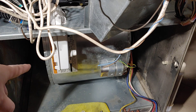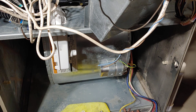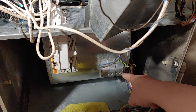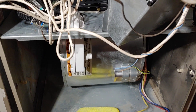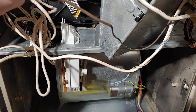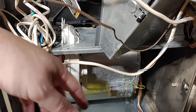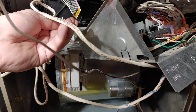I got the motor for $150. This capacitor is literally $5 at a Grainger location, in case you can't find an actual supply shop that'll sell to you. This is most commonly the thing that breaks when your blower motor goes, because this thing just gets weak over time. That's already been replaced. I'm not doing this to piss off guys that do this for a living — I'm literally just doing this for the average homeowner that maybe doesn't have the $1,500 or so to pay someone to do this. Just make sure you have the skill set to do this, but as long as you can unscrew stuff and put stuff back together, I don't really see what the issue is.